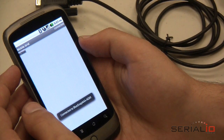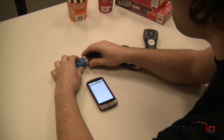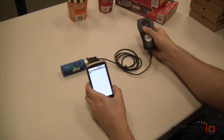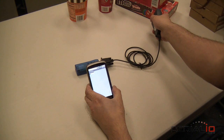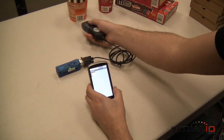Now the BlueSnap AAA is connected. Plug in the RS-232 device into the BlueSnap AAA that will be sending data. Here, we will use the LaserChamp laser barcode scanner with RS-232 serial interface. Simply scan barcodes and they will show up in the Mobile Grid app. You can send any ASCII data to Mobile Grid that is terminated by a carriage return.